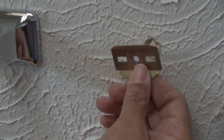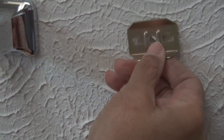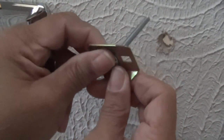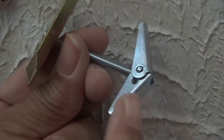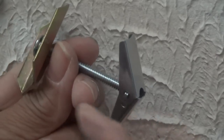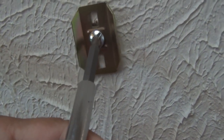Now we're going to attach our anchor plate to the wall. Don't worry about the hole being so large because the plate will cover it. I'm going to take that toggle bolt and insert it into our plate like that. Now I'm going to attach the little wing section — you want to make certain that the wing section is folding in. So it's folding in, and now we're going to insert it in the hole — collapse the toggle bolt and just stick it in.